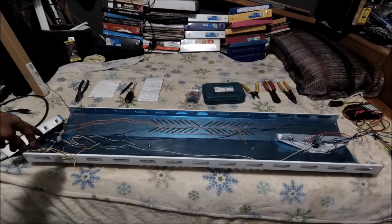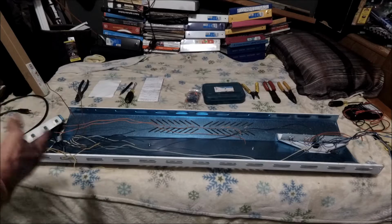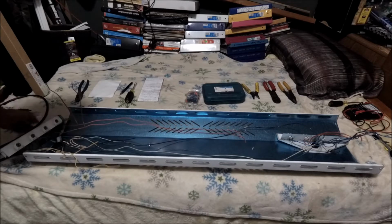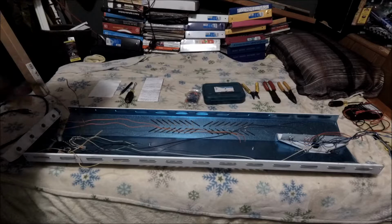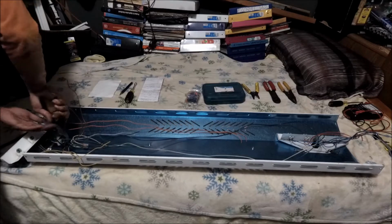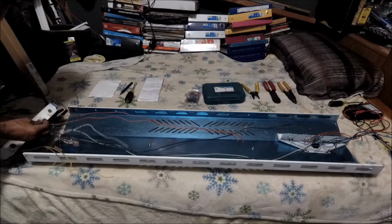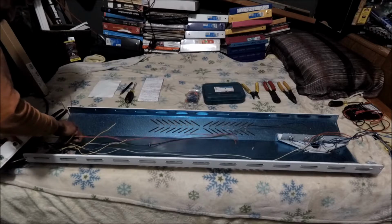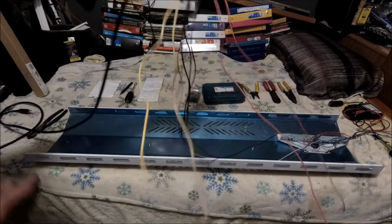So what I'm gonna do, so I can have more accessibility to the whole tombstone and the plate and everything, I'm gonna remove this grounding conductor that is attached to the frame, alright? So I can go ahead and move this around and work with it with ease. Remove this grounding conductor, loosen up the nut, lefty loosy, to your left, counterclockwise. You just loosen it up with your fingers, and there you go. Then just put the nut back with the bolt, so you won't lose it. And now, look, we have access to this. Now we can move it around, and I can show you guys.